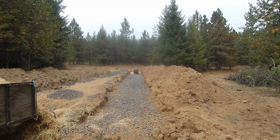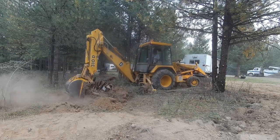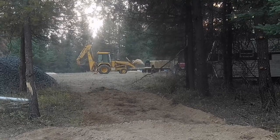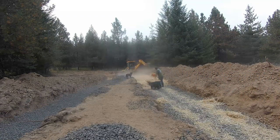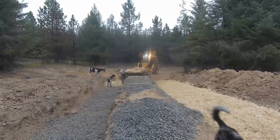I was doing one side with the wheelbarrow, then started on the other side and had to drive all the way around. I brought straw up in the bucket — about 10 feet of straw at a time — then pulled the dirt in to cover the straw and went for another bucket. To get into one section I pulled out a tamarack stump so I could drive around without poking a hole in the tire. I tried to fill both ditches as I came along to give me more room to maneuver. As I filled them in, I tried not to drive over the pipe — either driving in the center or on the outsides of the ditch line so it didn't pack too solid on top of the pipe.